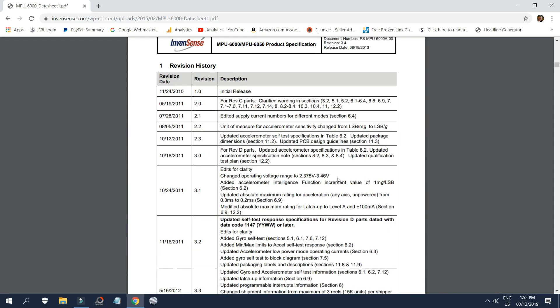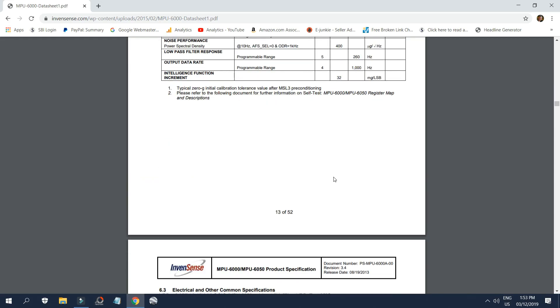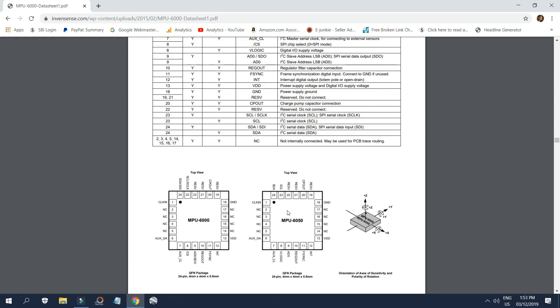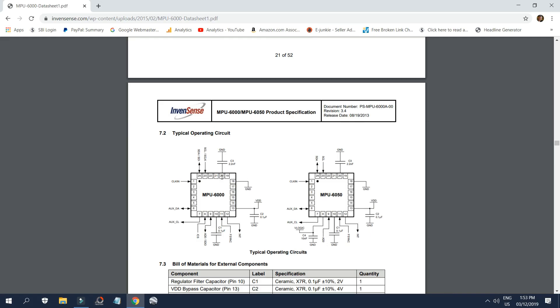These are a really powerful little chip — it's amazing all that they can do. If you're interested in this kind of stuff, take a peek at the datasheet for a really cool appreciation of the technology crammed into this thing. Looking at the pinouts: the orientation dot on the chip — when on the board, this is the left side of the helicopter, this is the front. It's the second pin from the right top corner, so it's number 20: CP out, which stands for the charge pump capacitor connection. Looking at a typical wiring diagram, pin 20 goes through a 2.2 nF capacitor to ground — and that's exactly what we saw on the circuit board of the K123.